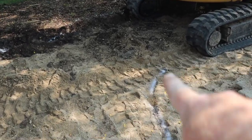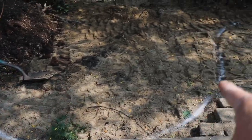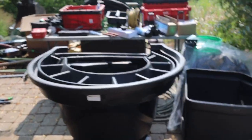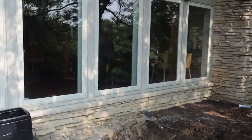We're going to do a stepping stone bridge right across this area — boom boom boom, right where Luis just walked across. We're going to do a Unilock wall, composite brick wall right inside of here, which will allow us to bring that patio right up over the top of this. Our skimmer box and vault are going to go in this area, electrics have got to move over to this space, and we have jets going over there and waterfalls coming from there. We'll have two bio falls — a skimmer box feeding two bio falls, and a vault feeding some jets.